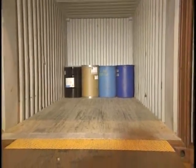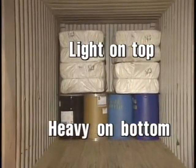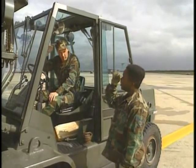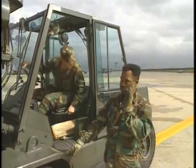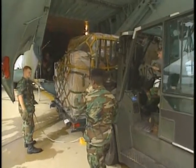When loading a trailer or railroad car, remember to distribute the weight evenly. If you are loading pallets containing materials of different weights, put the heavier loads on the bottom and the lighter loads on the top. If your load is large enough to block your view and you must travel forward to put the load down, you may need a helper to guide you. Before starting, agree on hand signals with your helper — signals for moving to one side or the other, raising or lowering the load, and especially a signal for stop. The operator moves very slowly and keeps the helper in view at all times. Anytime you lose sight of a helper, stop immediately. Even with huge loads being placed in a tight space, professionalism, proper training, and following each and every safety procedure gets the job done safely.